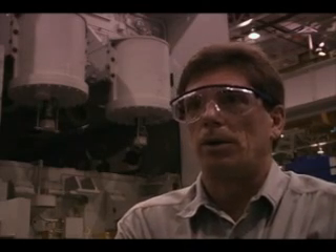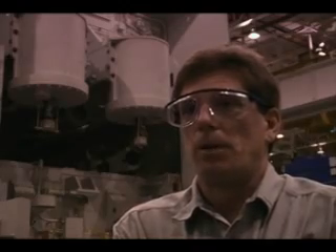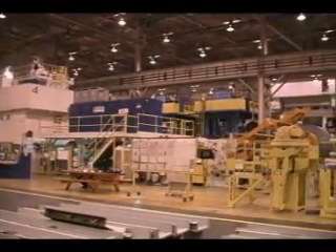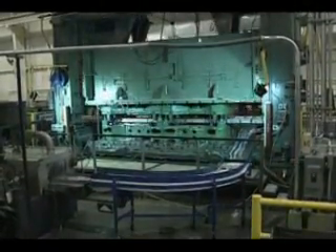And also the time involved — I thought it was going to take several hours, and to be picky about ten thousandths, I didn't know if it was worth it. It took them 10 minutes and it was definitely worth it — we're right where we want to be now. Not just the savings of the installation portion and timing and the readiness of re-leveling when you need to, but also the vibration and the impact to the press as far as softening and keeping the wear and tear of the press to a minimum over a period of years. In mechanical driven or electronic servo driven presses, the Vibrodynamic pads long-term save the wear and tear of the internal parts of the crown and any mechanical pieces on that press.